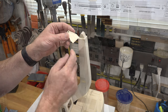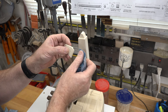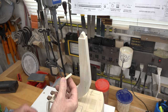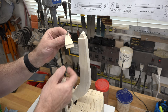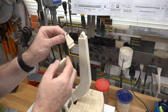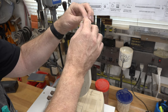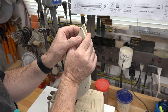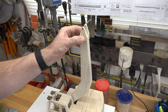Those pieces are done. There's a chamfer on one end, sanded by hand using sandpaper on MDF. Now we fit and glue them onto the boom — alignment is critical since the holes must line up perfectly. Here's a tip: use the same drill bit you drilled them with, and just insert the shank through the holes to align the pieces. It fits perfectly with no deviations, so you know everything is exactly aligned before you glue and clamp them in place. Once dry, just remove the drill bit.